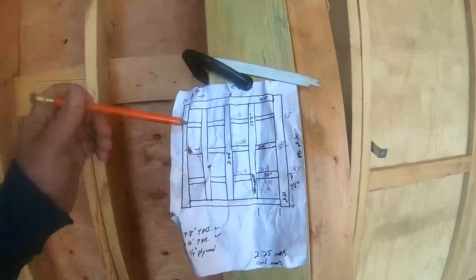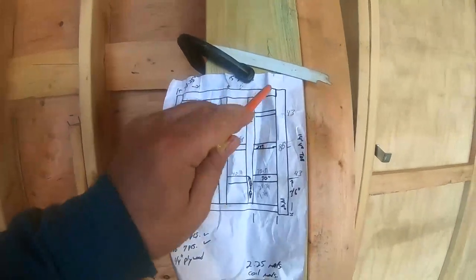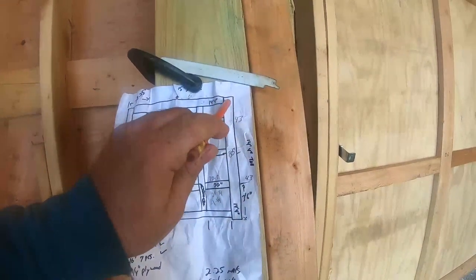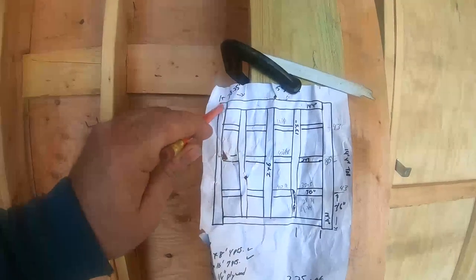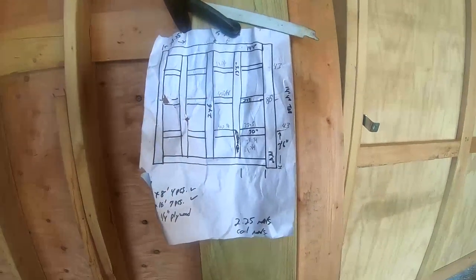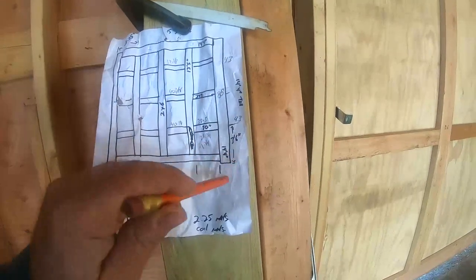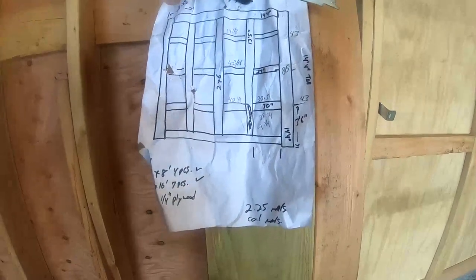Here's a hand sketch of my door. This is the top piece — that's the two-by-six. I didn't go all the way across; I have two verticals that go from top to bottom. I have a roller mounted here, a roller in the center, a roller mechanism for the track, and another roller on the end. The reason I did this is so everything isn't just hanging off the top — this roller is bolted to this piece, so I think it gives better support instead of the whole door hanging from the top only.